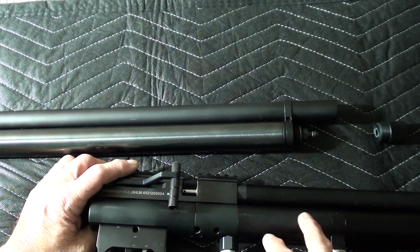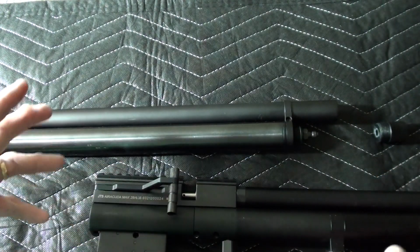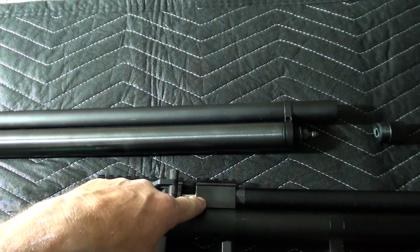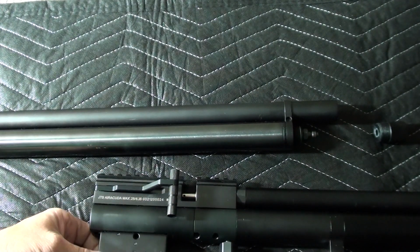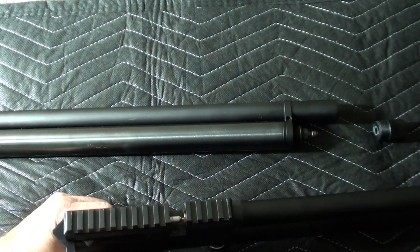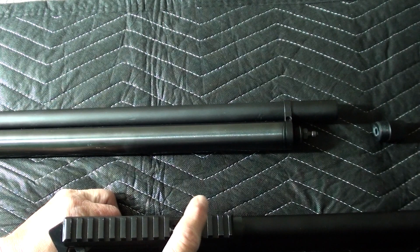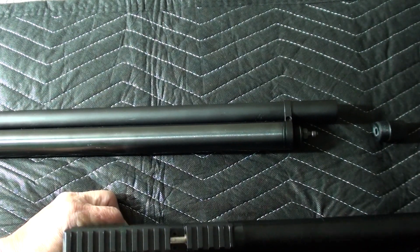So like I said, you undo those screws, pull this forward about 1/4 inch, and it comes out. Do what you have to do, change O-rings, whatever you need to do, put it back in, and make sure that O-ring is there for your transfer port. They both use a similar bolt. There is an O-ring inside the thimble here that seals on this type of bolt probe.